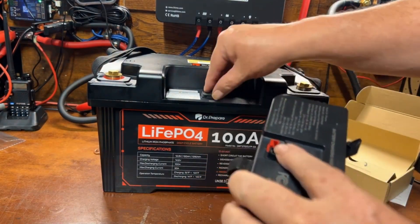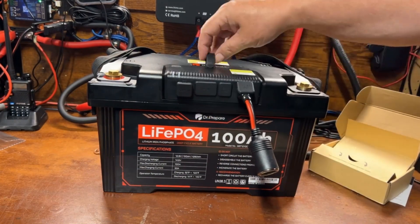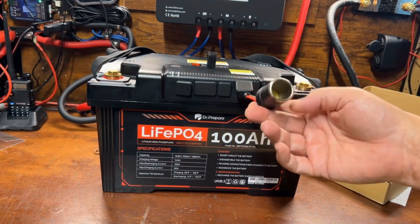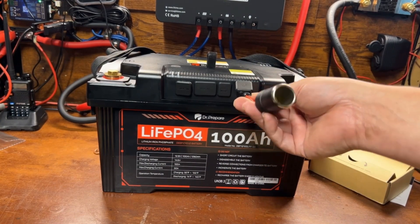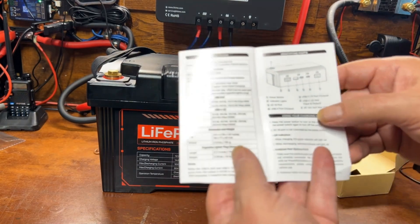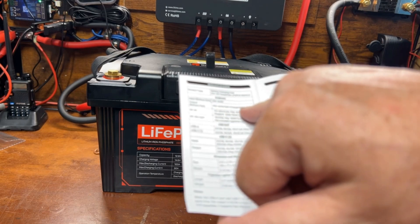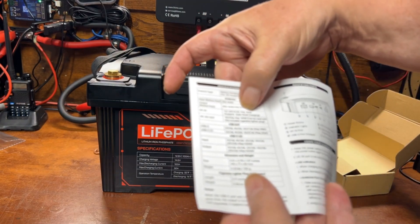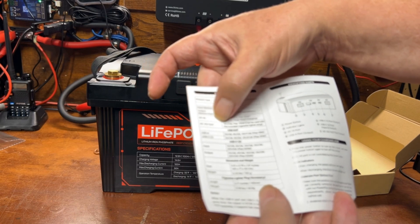On the bottom there's the power pole connection — this little flap folds down and connects in here with a nice pull tab so you can remove it whenever needed. It's important to note this is a 10-amp maximum port, like a typical cigarette lighter port. The output is 10V to 14.6V at 12 amps to charge the battery. DC input is 11 to 25 volts at 4.2 amps max, 84 watts — that's the supported solar panel charging. The 12-volt output is 10 amps max, 120 watts.